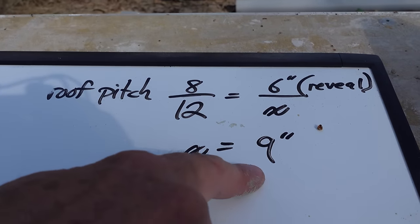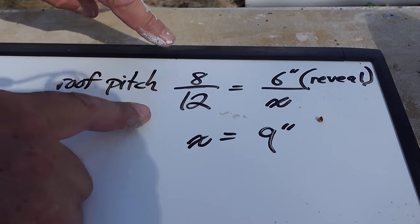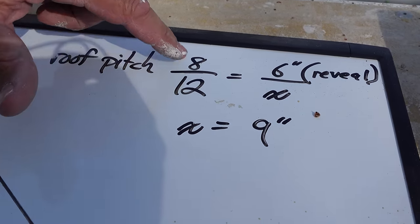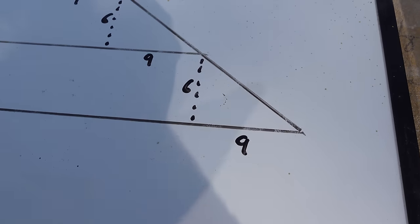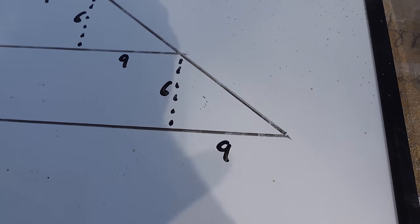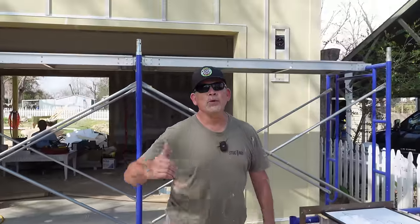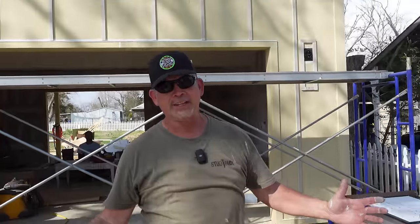Here's our reveal — 6 inches — and this distance is 9. Notice that 9 is half of 18, the number I was subtracting. Since we have a double peak, each side is 9 inches shorter, so each board is 18 inches shorter total. I could pre-cut them all and pass them up, and that's exactly what I was doing — it worked great. Gotta trust the math. You might be asking why whole numbers — that's just how the math worked out with an 8/12 pitch and 6-inch reveal. Plug your own roof pitch and reveal into the congruent triangle formula and you'll get your own decrement number.